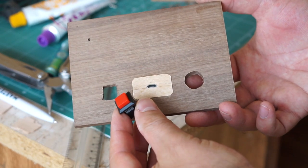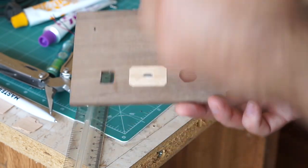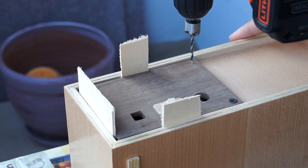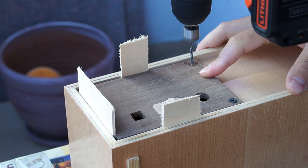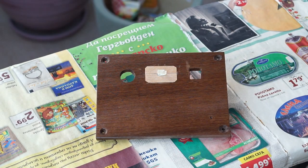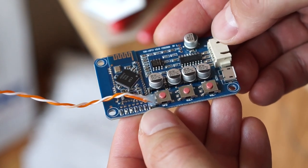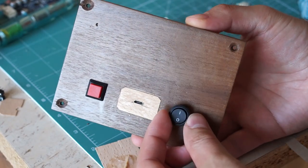The next step was to cut two more holes: one for the button that will put the Bluetooth receiver in pairing mode, and another for powering the speaker on and off. Before gluing these two buttons, I placed the piece on the back of the speaker and drilled holes through which the screws would later go. Then I could spray the back plate with lacquer. All that was left now was to complete the wiring. I soldered wires to the pairing button so I could connect it to the button on the outside of the speaker. I also wired the power switch to the power wires, and that was it.